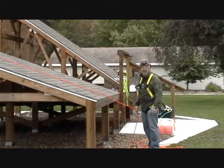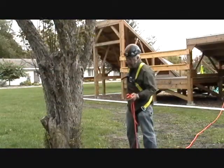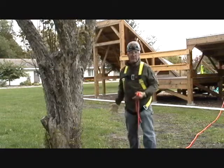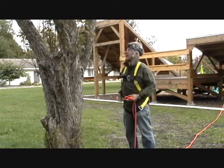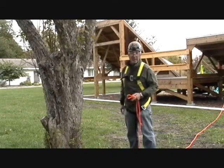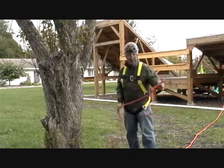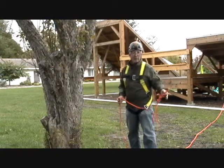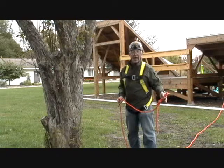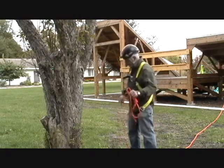No twists and kinks in the rope. Let's head over to the other side, inspect our anchor point, and learn one more knot. Okay, so here we are. We have a good stout tree, one with plenty of support in the root system. So if I fall, it's going to hold me. Not a giant tree, but certainly stout enough. What I want to do is wrap this properly around the trunk of the tree about three times, so I need to go around three circumferences of the tree.